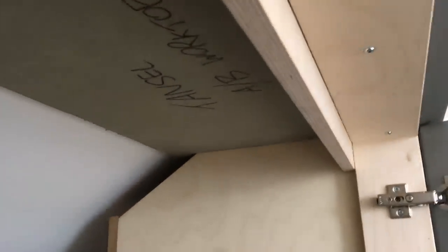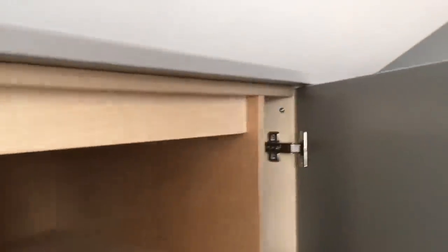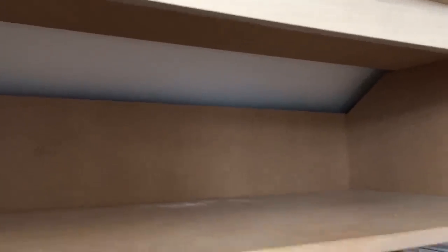The other issue, now I guess getting on to mistakes and things that had to be rectified, was I realised a little bit late that this long span really needed some support. So we fixed these beam-like pieces of birch ply on edge after installation, including here, because again, these were not as structurally strong as they normally would be, because there's that cutout there, which I didn't feel particularly needed a piece of wood in, but does mean that it's weaker.